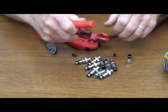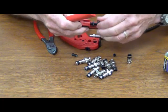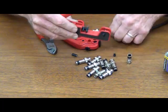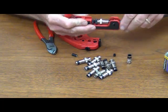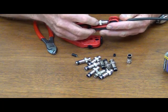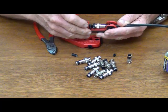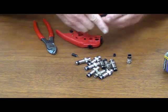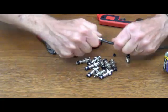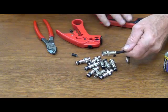It's ready to be crimped. This one's going to have to be adjusted — I'm going to unlock my nut. I know I'm going to have to go down quite a bit. You can see it's a little longer. I need to keep turning it until I'm about equal spacing between what I'm going to crimp and what I see between the end of the connector and the base of the tool. That's about right there. And then I'm going to crimp it. We're done. COSmart 2 Connectors, BNC, RG6.